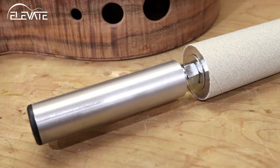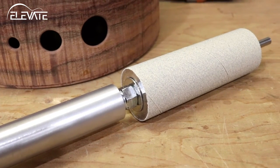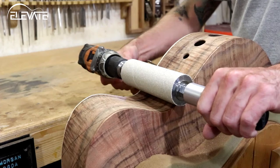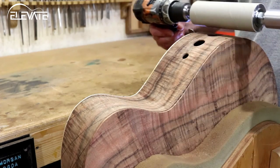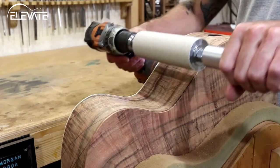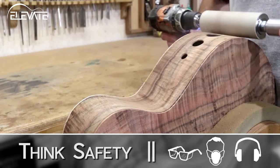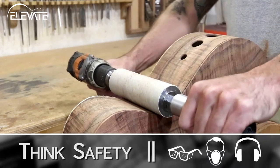To use your Elevate Rolling Pin Sander, first place it in contact with the sides with nothing moving. This ensures you aren't tilted to one side or the other. You'll move the sander in the opposite direction of the rotation of your drill — so if the drum is spinning away from you, you'll move it toward you. Moving in one direction and stopping between passes is recommended, as moving back and forth is a good way to accidentally round your sides.